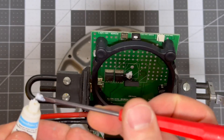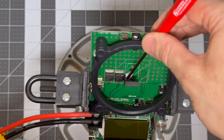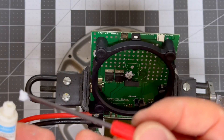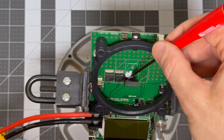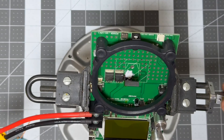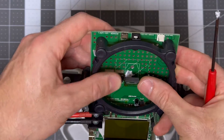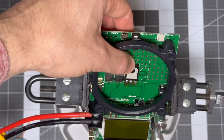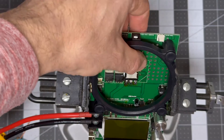This thing's busted as is, so if this makes it work, great — if it doesn't, well, no worse off. I'm just going to try to give it every chance I can to dissipate heat effectively, and that's where this thermal paste comes in. Now I should be able to fold the MOSFET down, and if I've done everything right it'll kind of fall into its original position, which is actually marked on the board. That'll ultimately get held down by the heat sink.